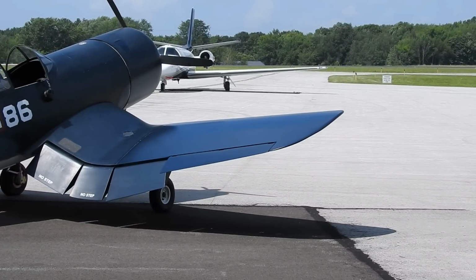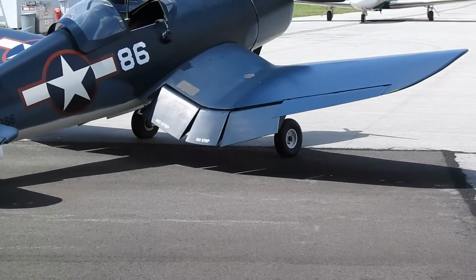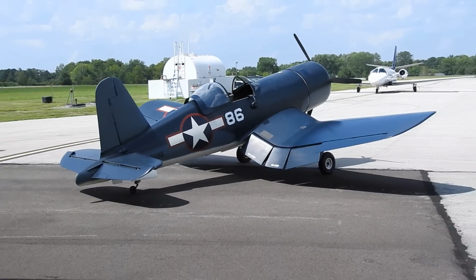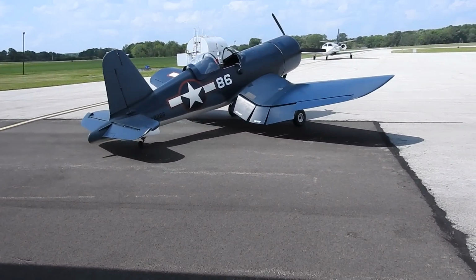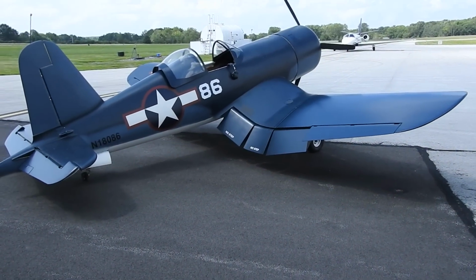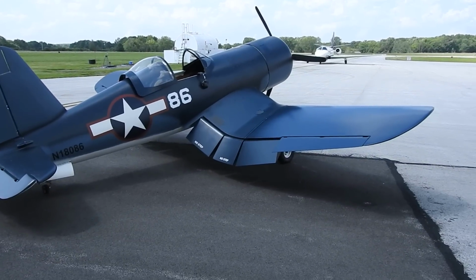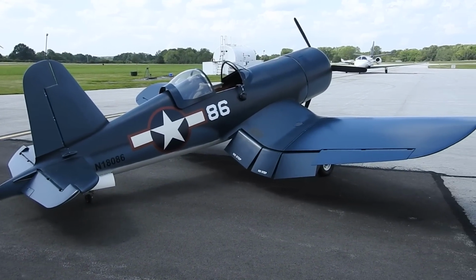All right, folks, there we go. That's just a little quick demonstration. I headed out yesterday for about 15 minutes running around. Wanted to see what the water temp was going to do, and it never went over 200. The thermostat on this thing is 197 full open. That's all I wanted to do, get it out and run a little bit. A little too windy to play around today, so I'm going to go ahead and cut this off short.